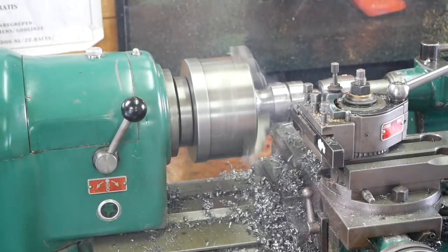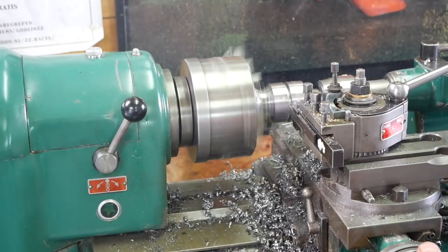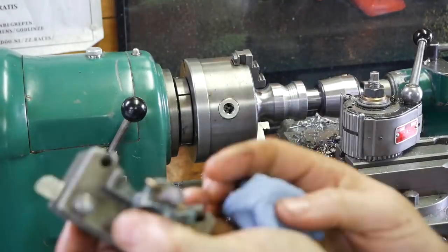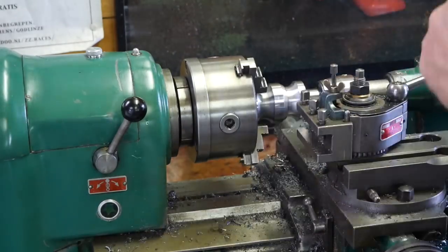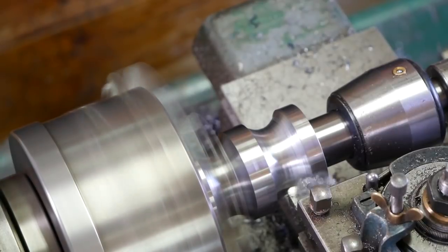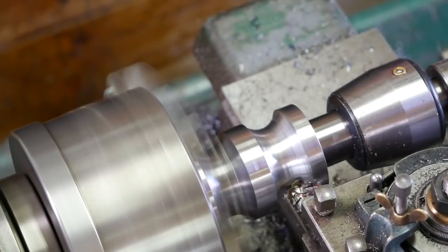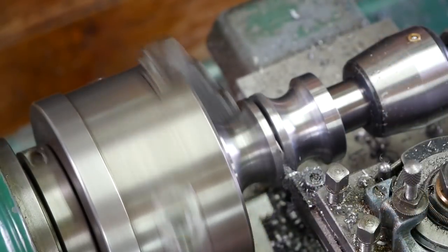And for the first test run of the roller, I made these rollers for 20 mm tubing. The nice thing in the design is that they all have this 20 mm hole inside, so I can use it on the roller but also on the bender themselves. So that saves me some time in making these rollers.